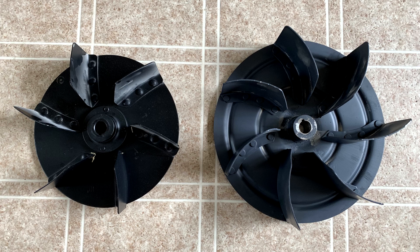The good news is that I have 240-volt service in the garage and that motor is convertible to 240 volts. Put it on 240 volts, it draws half the amperage, and that's on a 30-amp circuit. So in order to make this larger impeller work, I'm going to have to convert the motor to 240 volts — which it's designed to do. It's a win, just not a win just yet.